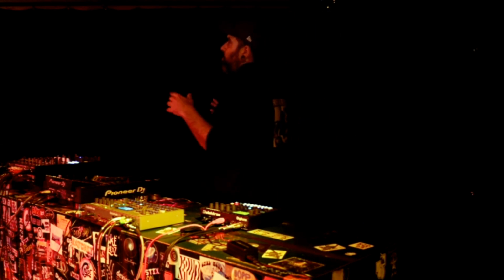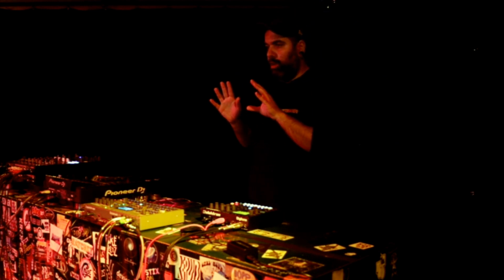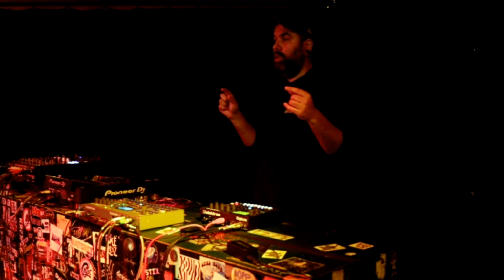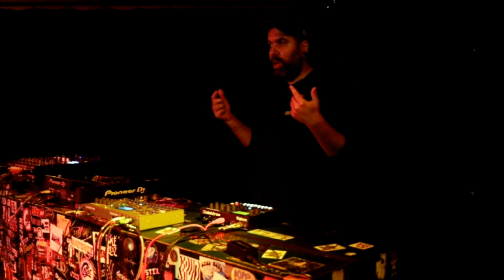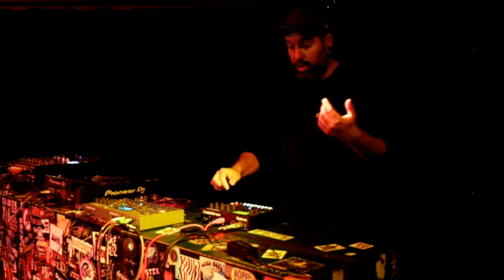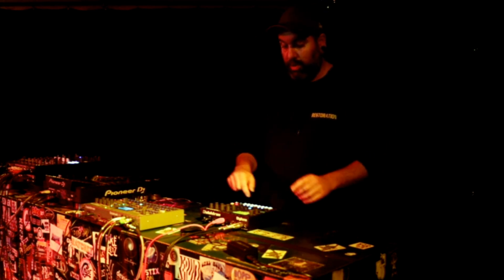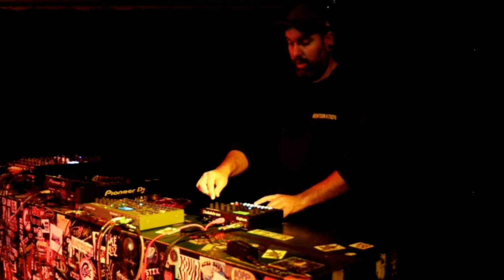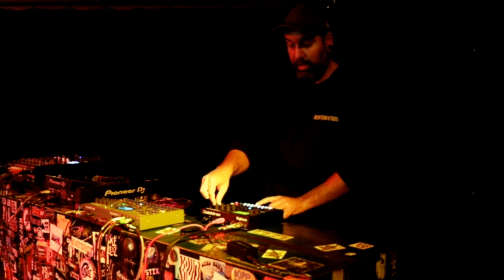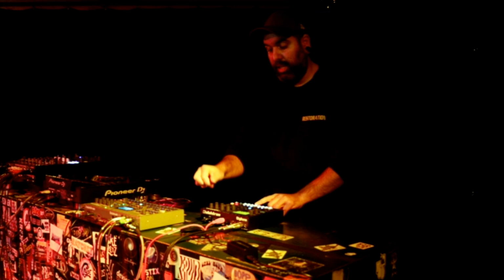Then once again, the LFO parameters of the Elektron have this thing that you cannot see in 1 bar, half bar, 2 bars, 1/8 bar. On each machine they have these things called multiplier and speed. The time of the LFO is the combination of the multiplier and the speed. If you want slow modulation, you keep the multiplier at 1. And if you have the speed at the maximum, you have a 2 bar modulation. If you put the speed to 32, so half of that, you have 4 bars, and so on.